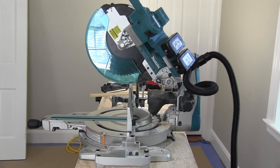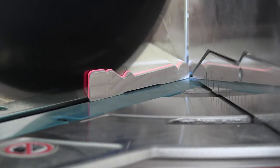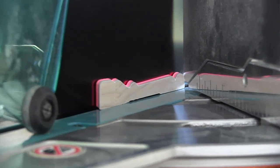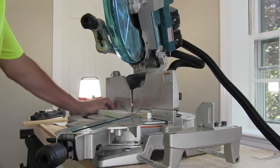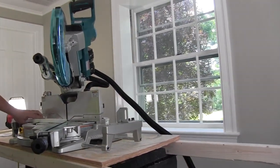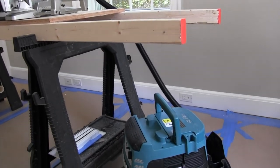This tool also has electronics. Like a lot of these expensive tools, you want to protect your investment. The electronics automatically adjust the cutting speed and torque depending on the cutting application demand. It also features a soft start motor and electric brake. There is also overload and overheat protection where the tool will stop working and the battery indicator on the tool will blink for 60 seconds, letting you know to ease up.